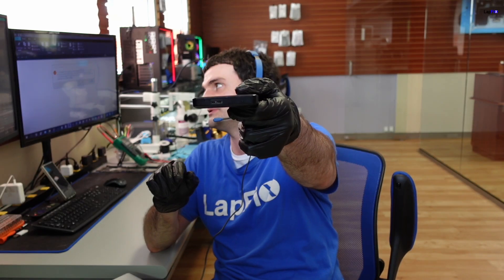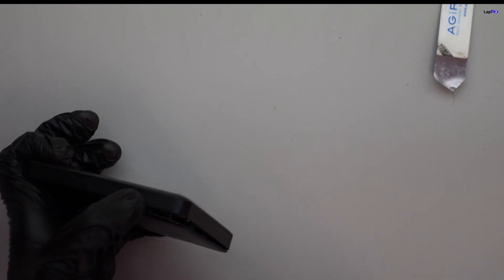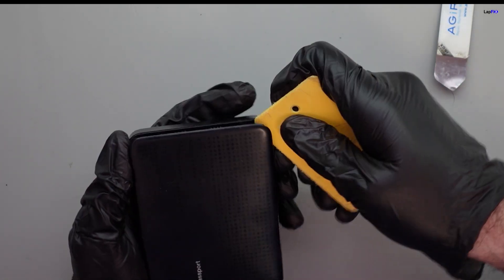So let's go ahead and actually see what's going on inside there, because obviously it's not able to be accessed. It just keeps connecting and disconnecting. We need to see if there's a problem with the port or what else is going on. So let's actually take a look at it — let's open it up. We'll start with a thin edge pry tool and then do the rest with plastic, because we want to see what's going on inside.